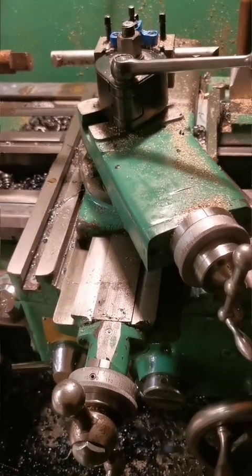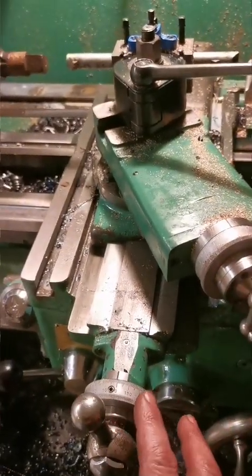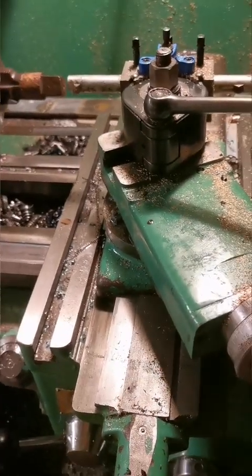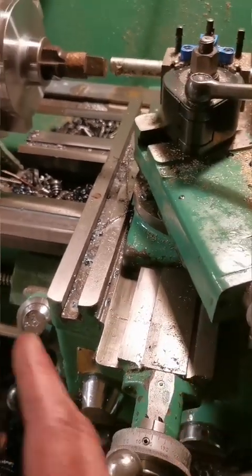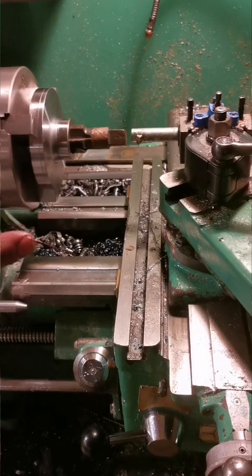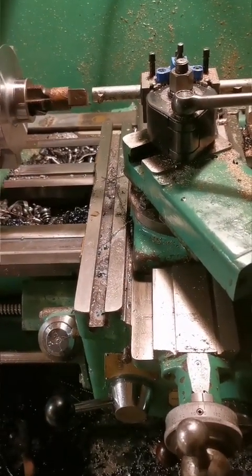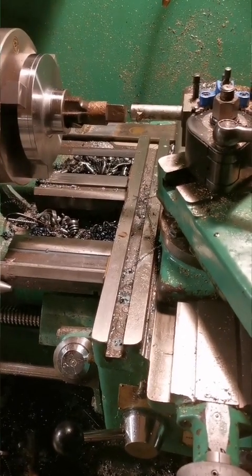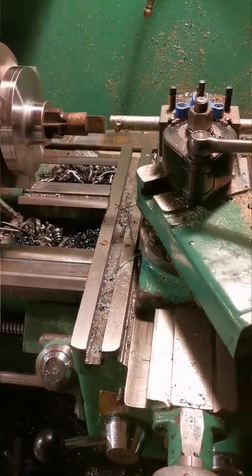The great advantage of using this setup is all about the backlash. On many lathes, you'll lose a couple of inches of travel of the carriage before the taper turning starts to do its thing, and by running with the spindle in reverse, tool upside down and moving away from the chuck, you eliminate that issue with the backlash, and you attain a far greater degree of safety than you would with the conventional method of working towards the chuck while screw cutting.